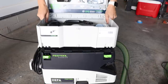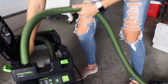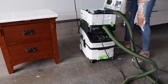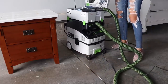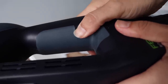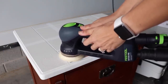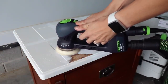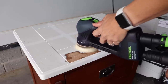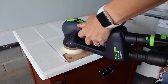This top box is actually what the sander comes in, and this bottom portion is a dust extractor. The hose folds up nice and easy when you're not working with it. The dust extractor is also on wheels and the sander clips on top, so it's really easy to move around whatever project you're working on. I'm going to use a 60 grit pad in Rotex mode to strip off this paint. It also has a speed variation on the side so you can control the tempo — since I'm stripping finish off, I want to stay around a four, five, or six. As long as the dust extractor is turned on every time I turn my sander on, it kicks on and sucks up all the dust — really close to dustless sanding, which is amazing.